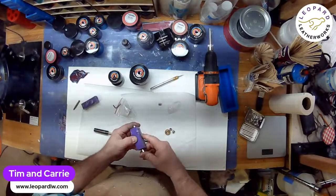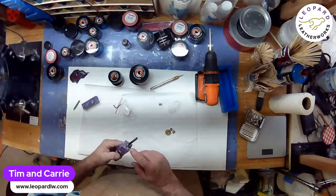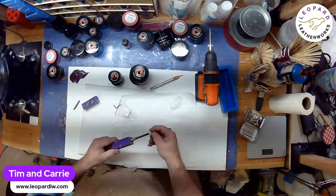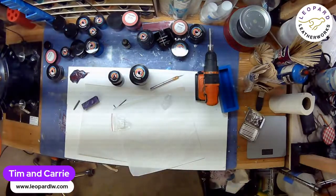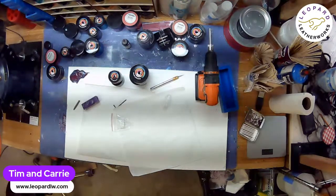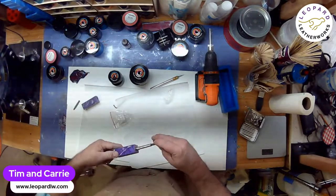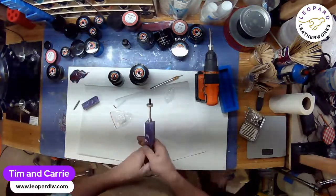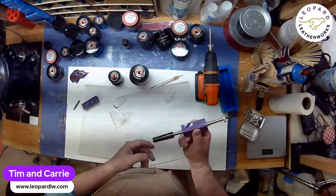So those fit in there, and you put this on the mandrel. All of these bushings are always drilled out to the size of the mandrel. You put these remaining spacers on here. And I should have one more spacer over here. And there it is. The whole idea is to cover up some threads. So when you tighten this up, you can tighten it right down on there and it's super tight. Now this will spin when we put it in there. This again is a Morse taper 2 that will go on the lathe, and I'll show you how that works.